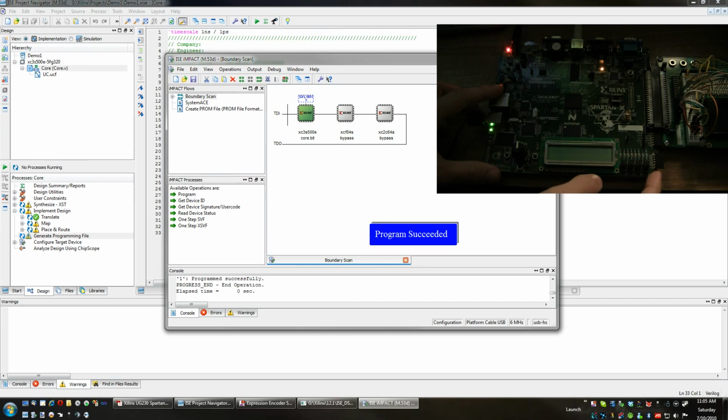Now, let's go ahead and move these two switches on the right, which are the least significant ones that we used in our project. Turn one high, two high. You'll notice that that least significant LED that we assigned the value to has now lit up. It is a basic hardware AND gate. Any one of these goes off, and so does our LED.